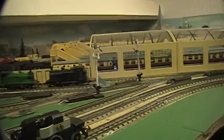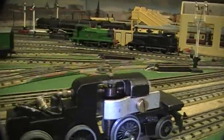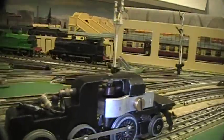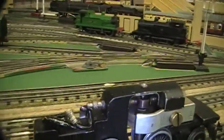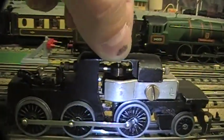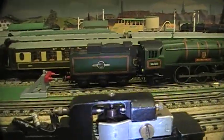Seems to work. Listen to that — you'll notice it is a little bit more noisy than the original magnet. This is because there's probably a little bit of play in the top bearing and it's shaking back and forth as it turns.